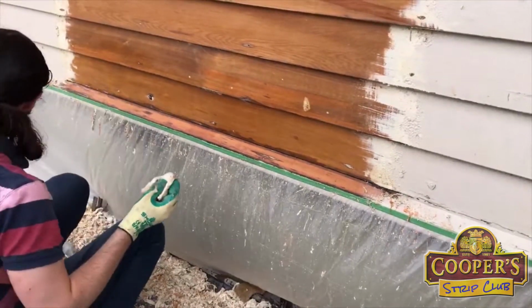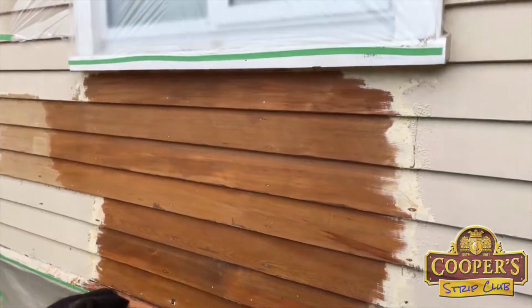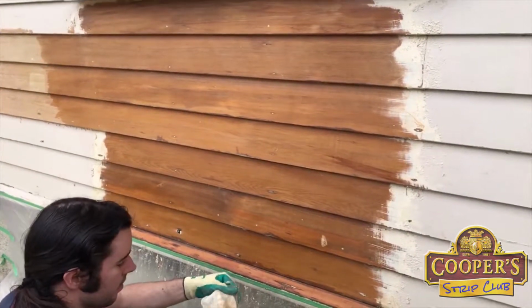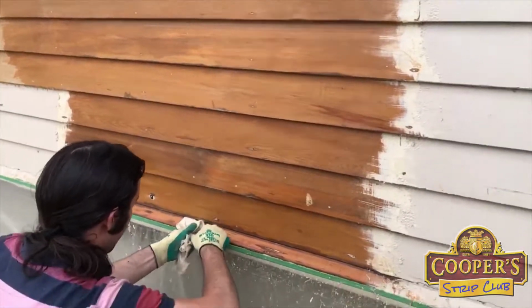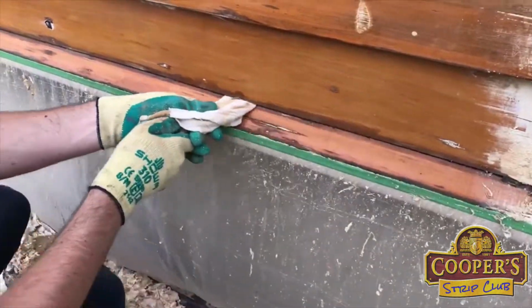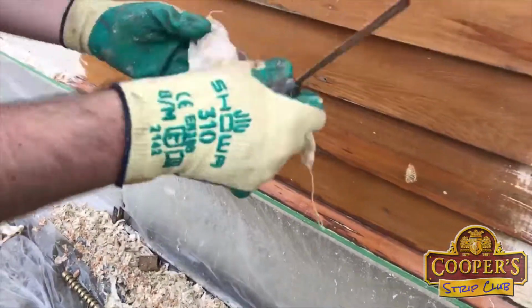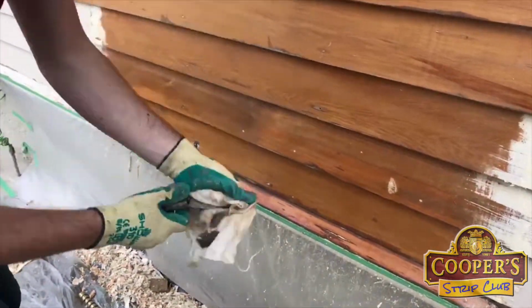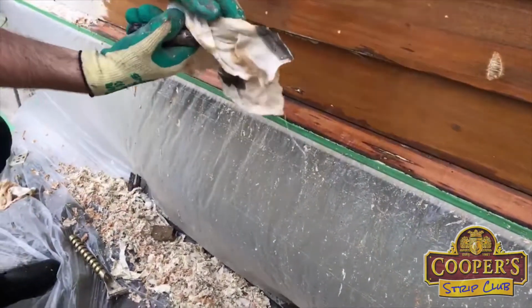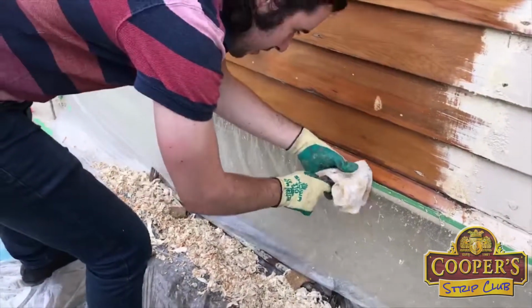Wow. That looks pretty done, George. It does, doesn't it? Now you see this rag around the blade? This is a pretty cool trick. You just move into those parts. Can you show that again, George? Sure. Get your blade, get your rag, strap it over it, and then you insert it into the groove and you just drag. And that just pulls out all that gunk. That little storage that we've put into it, it holds onto the rag really well.